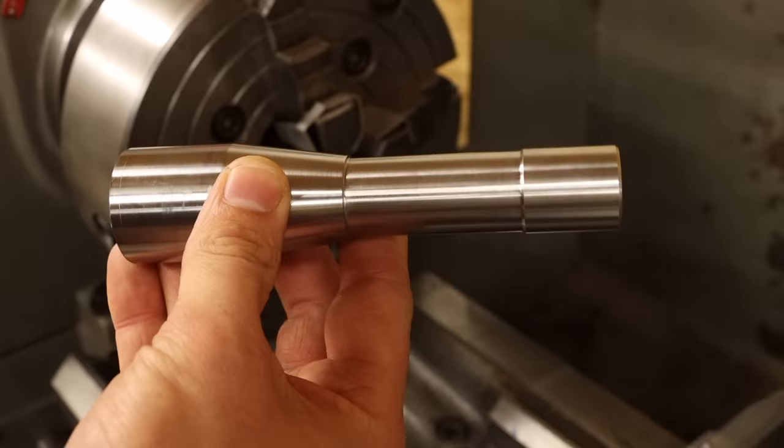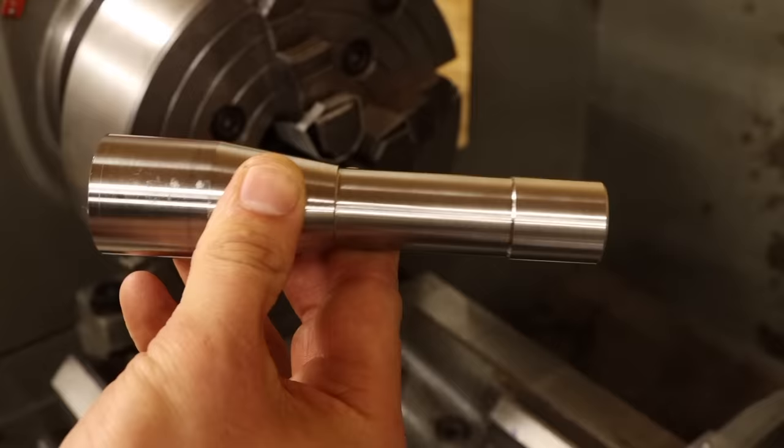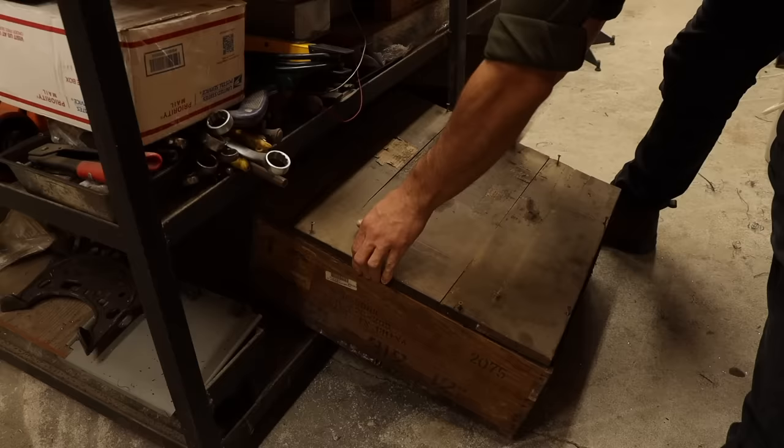And that's it for the lathe work. Let's go visit the mill for a bit. Up first is cutting the keyway on the R8 section of the arbor. While I'm tempted to use the rotary table and chuck adapter to hold this in the mill as I've done in the past, that just seems like way too much work for a single operation like this.